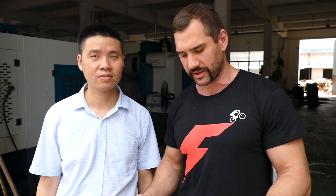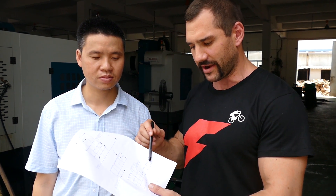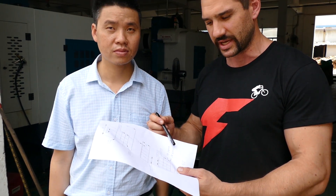There are quite a few solutions we've come up with. Firstly, we found the measurement of the gauge — it's accurate within 20 microns, which is 0.02 millimetres. We found out the minimum, max, tolerance, and then we laser measured all of the gauges. We found one of the actual gauges was 10 microns out — 0.01 of a millimetre. We don't want to release anything that isn't absolutely perfect, obviously. So we're making new gauges that are completely within these tolerances. That's the first thing we've worked out.